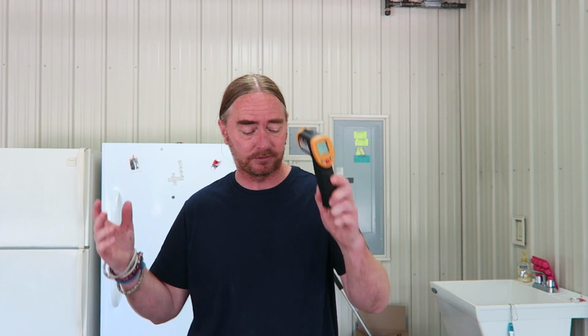That way the ice itself, it's impossible for it to bring that resin below 32 degrees, probably closer to 34, 35-ish, which is going to be a little bit cool if you were to leave it in there for that long. But like I said, put it in a cooler with some ice, leave it there for 5-10 minutes. And if you have one of these little infrared thermometer temperature lasers, check it. I wouldn't push it much below, say, 50, maybe 45 degrees before you start to catalyze it and work with it.